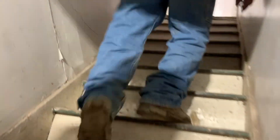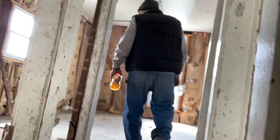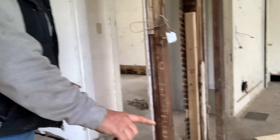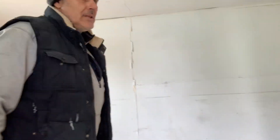We're going up the stairs here very slowly, so be careful. The LVL that we showed you downstairs is what's holding these floors up here. These floors are a little bit unleveled up here too. So after we get that LVL in and put the floor in downstairs, we're going to come up here and jack these floors up and get them all level and straight. After that, we'll be doing the electrical and drywall. The electricians are coming in Monday, and then probably a week to a week and a half after that we'll have the drywall done.